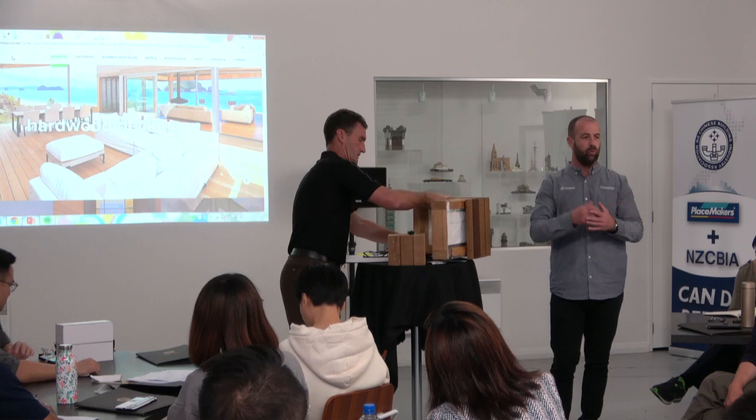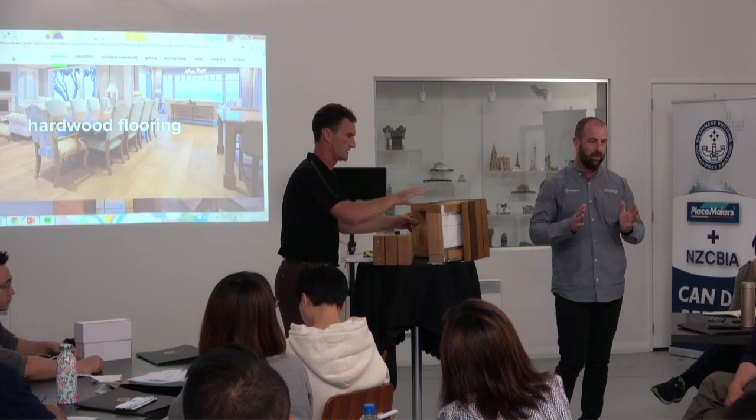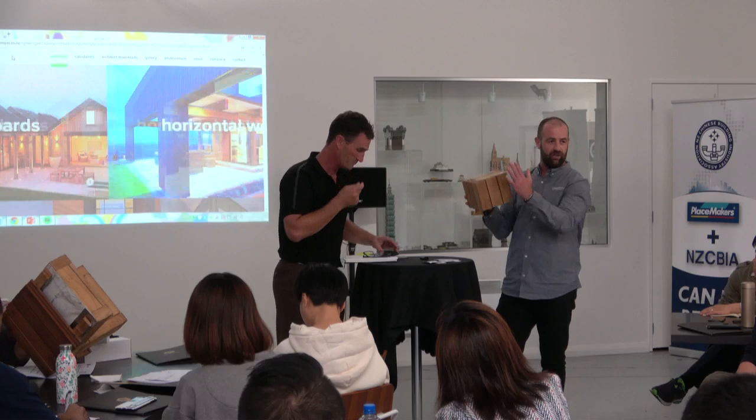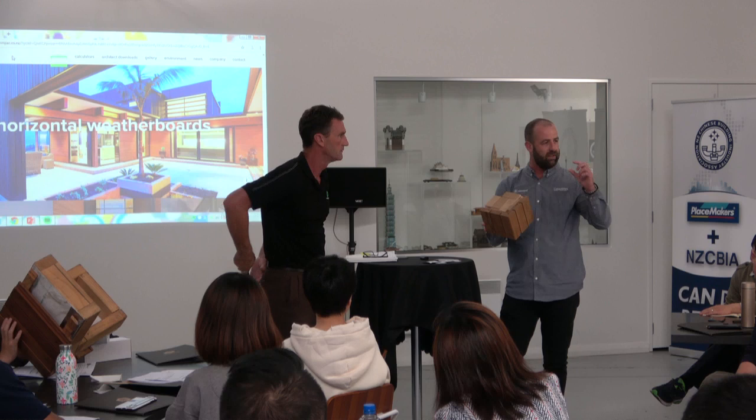Yeah. So the most important things to try and remember for the builder when he's ordering, or whoever is doing the ordering, when it comes to Hermpac product, is when they order the cedar, you want the builder to order the Vertibat, so it's the double bevel with the castellation. That's the pine version, the timber version. You can also use the green plastic Cavibat. I'm not too sure if you know this, but you can use that as well as part of the Hermpac system.